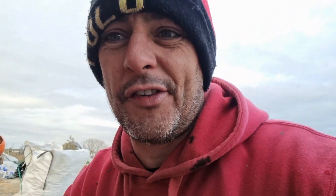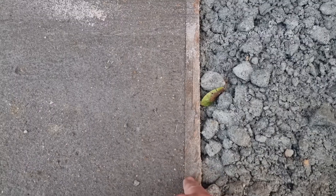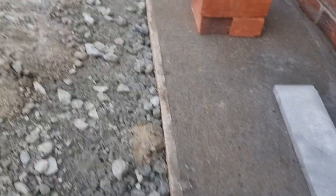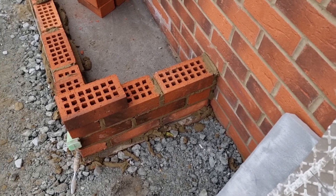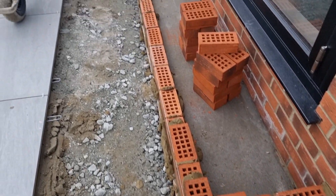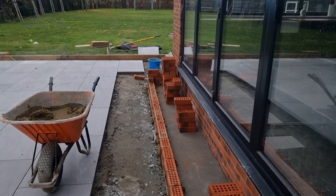Right, I'm governed by the size of this slab, so I've got to come to the edge where it hits the timber — basically that's my line all the way along and around. That works perfectly for slabs and everything on top. It's just three courses through here, so that's what I'm gonna build. I'm gonna start by dotting one on this corner, dot one the other end, then run it through and see what bond we've got. There we go, we're set out now all along there, first course down both ends.